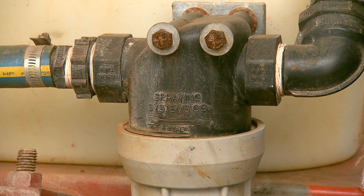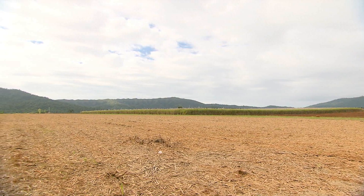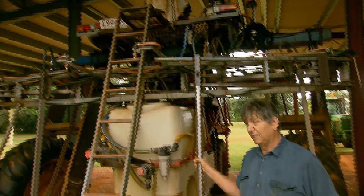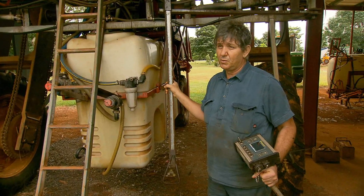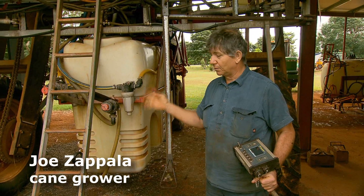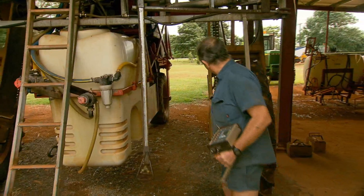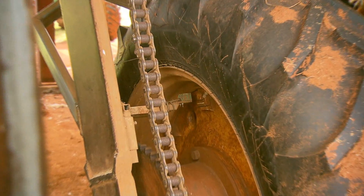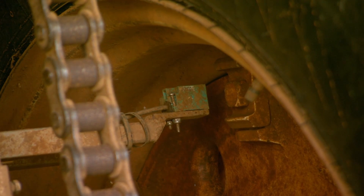It's a win both for the environment and productivity, and it also helps on his hillier country. This is an older machine that we converted into a high rise eight years ago. We had just standard controllers that were not very accurate — they did the job but they weren't very accurate. So we applied for more funding and got a variable rate controller. We mounted a wheel sensor on the back of the wheel so we get accuracy at ground speed, and once you've got accuracy with your ground speed you start getting accuracy with your application rates.